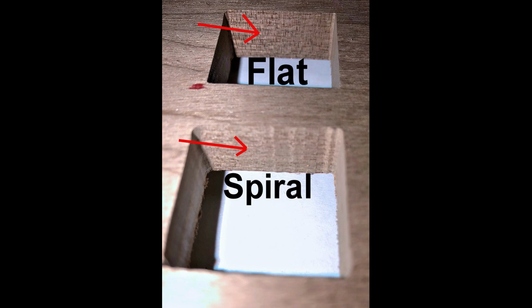making are rather organic. They're not squares or circles where you see the poor cut. If you're cutting an organic shape like a leaf and you move off the line a little bit, nobody's ever going to notice. So in that case, you can easily cut that pattern with a spiral blade and it'll look just fine. But if you're cutting out pieces like a toy wheel or something like that, you absolutely do not want to use a spiral blade to cut that out. You want to use a flat blade just to get the cleaner cut.